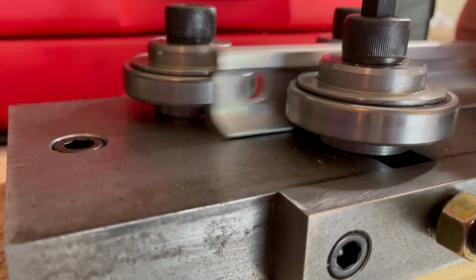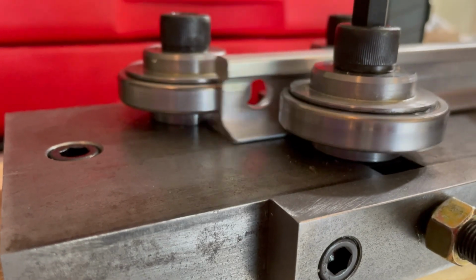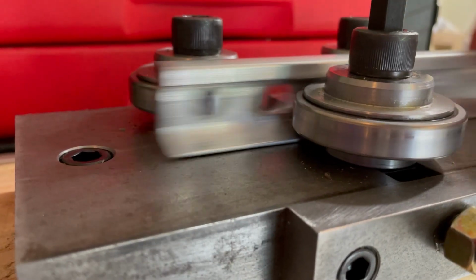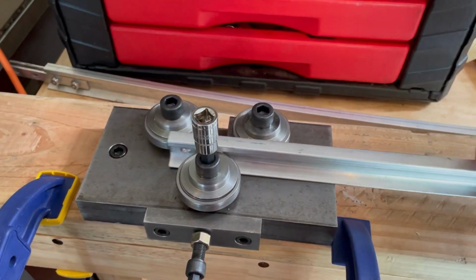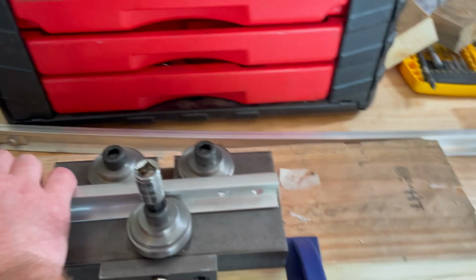You can kind of see it clanking through. But it's not the end of the world. Once again, you can just take a run at it. Once you get tension on and everything, you can get it through just fine. But something to think about if you're gonna drill holes yourself and get this kind of bender: maybe drill your holes afterward, and then you'll have a nice smooth exit and enter when you do each end.